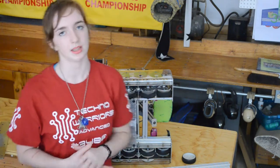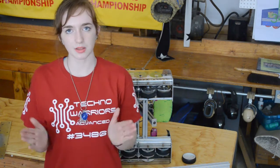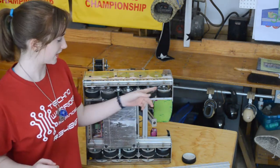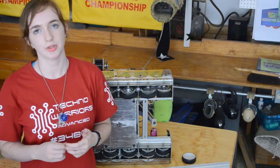The reason that we didn't use gears this year is because that was really hard on the gearboxes. The way the chain is, it's actually reasonably loose, so we conserve gearboxes and don't go through those nearly as quickly. We actually have stall code, which you can find in our notebook, so we don't really burn out motors, but gearboxes sometimes we would strip, and that was really a major improvement on conserving those. With our gear ratio, it's geared 3:2.